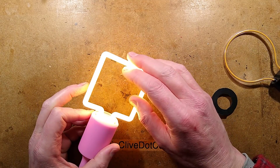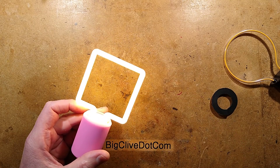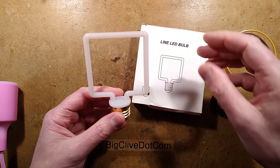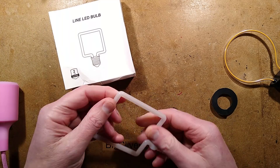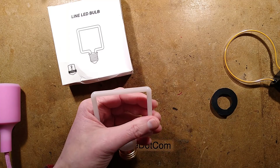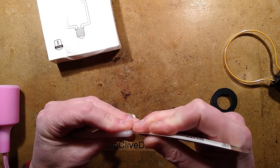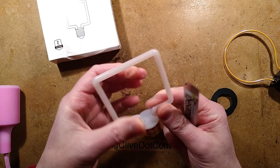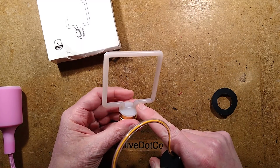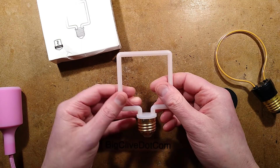And it was a really complex shape — there were stars, Christmas trees. And I was thinking, how on earth are they going to thread the filament down inside that tube? And how do they frost the glass tube? Well, they don't. If I take this lamp out — now you've seen it lit, that's important — it came in this box and it's not going to get damaged because it's plastic. The way they're threading it along is that this tube is glued. That's how they managed to get the two options — clear or diffused — and also how they managed to lay the filament in: they've laid it in and then sandwiched the two bits together.